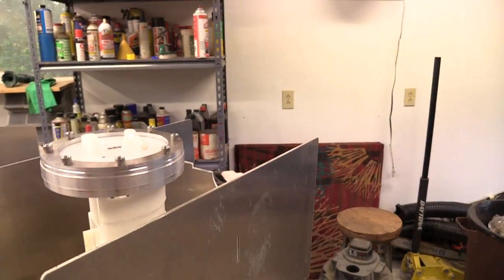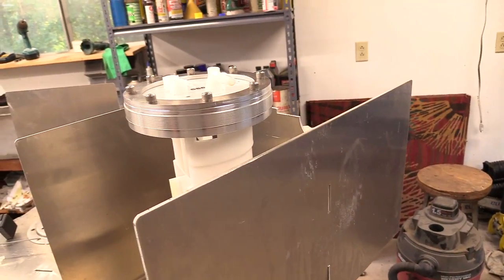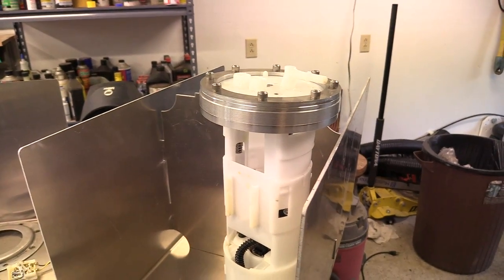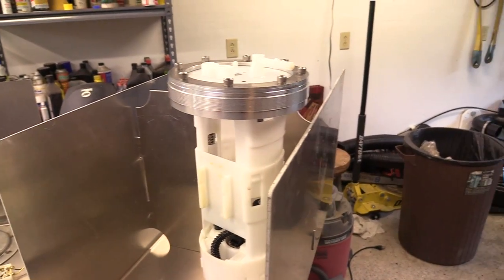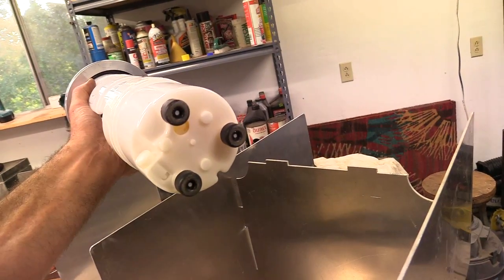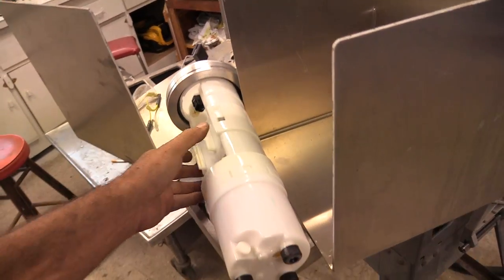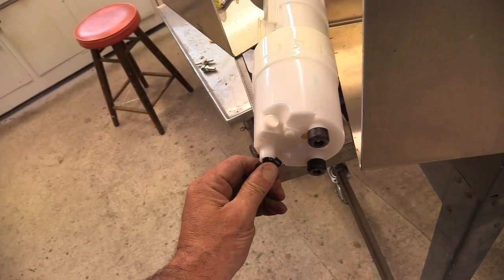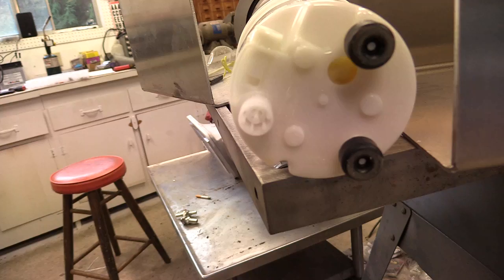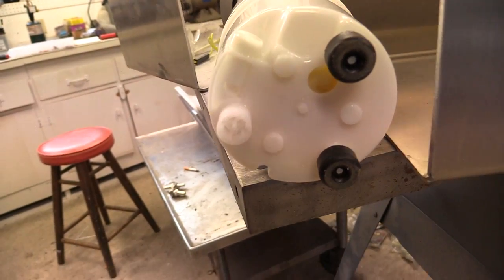I'm going to have to figure out how to increase the thickness of this — either cut out another ring, though that kind of sucks for welding because it'd be nice to have that thick piece welded straight to the tank. Or figure on cutting off the feet at least enough to where I can get that little bit more drop. I probably need an eighth inch or better, and that's where it'll bottom out. These things just kind of stick in there with little pins. I'm thinking I can probably just cut those off, maybe 3/16ths, and gain that much space.